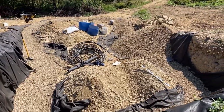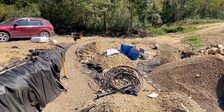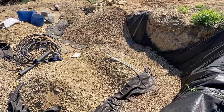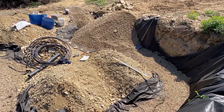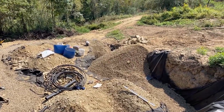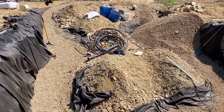I'm leaving these piles of earth because those will be part of the walls. Over there by my car are the earth bags. There's 1,000 earth bags in that bundle, polypropylene bags that I'll fill with earth. The next step is to fill those bags with gravel, and the first two, maybe three layers will be gravel bags, double bagged, and those will act as a break between the trench and the foundation and the wall to keep moisture from wicking up into the earth wall. The gravel obviously won't allow moisture to travel up it, and that's one reason that a lot of natural builders use rubble trenches and gravel, because if you use concrete, it will wick moisture.